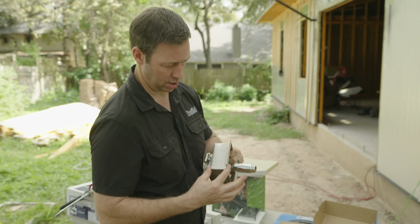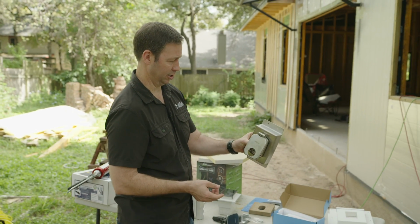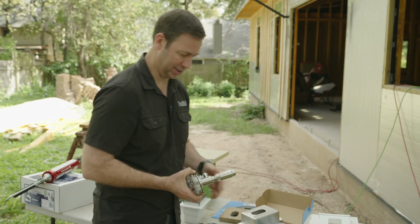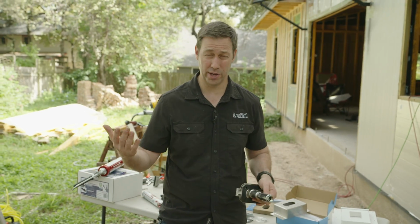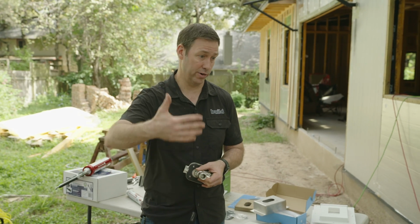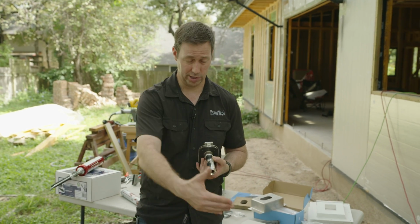This looks like it's maybe 1.5 inches, 2 inches, something like that. That's really slick looking. And what's cool about these is you can get them in a bunch of different sizes. This happens to be the 4-inch. So this actually shuts off 4 inches back into the wall. That's plenty for me in the south. If you're in the north, you may want to shut off 6 or 8 or even 12 inches back into the wall so you wouldn't have water close to the outside.